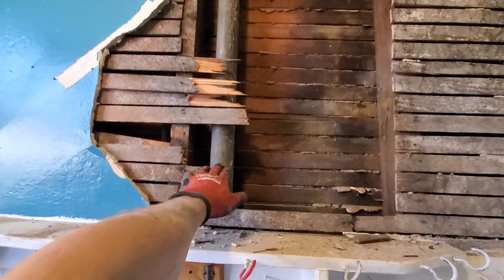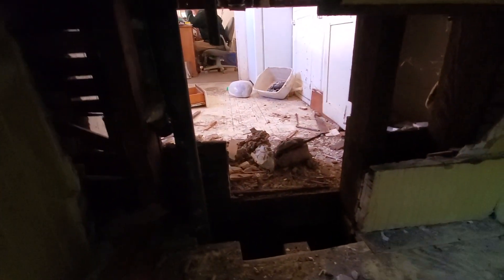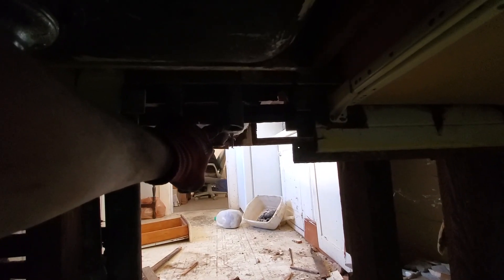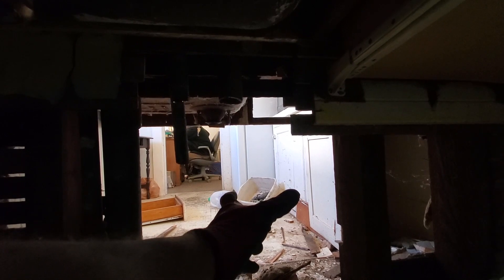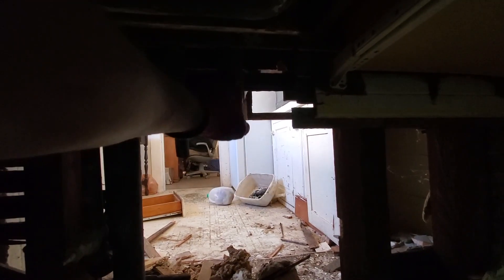The stack is right here, as you can see. It upsizes to two inch. There's a three-to-inch-and-a-half reducer right here, and then this inch-and-a-half vent 90s in the wall — right here. You can't see it but my hand is on it — it 90s and ties into this two-inch vent right here.